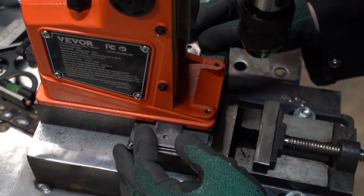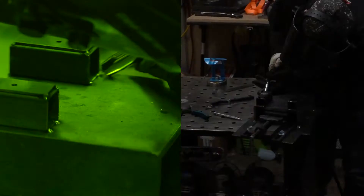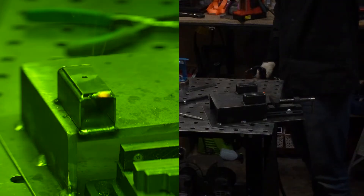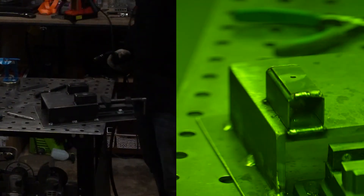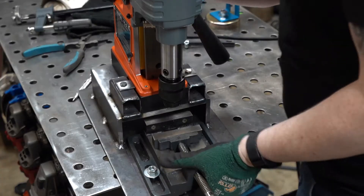I'm going to use quarter-inch bolts to connect the flat bar. If you've made it this far into the video, please consider liking and subscribing. Now that I've test fit the drill, I'm going to weld out my pieces of square tube and the shims. These welds ran really nice until the unthinkable happened — I blew through the 16-gauge square tube. I swallowed my pride, let it cool for a second, and slowly filled it back in. One day I'll learn how to weld. I cut the quarter-twenty threads from my strap bolts, cleaned up my strap, put it all back together, and tested out my strength.